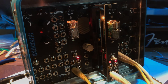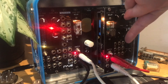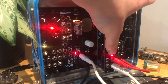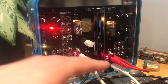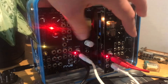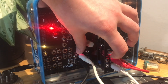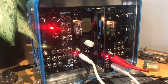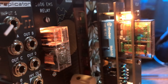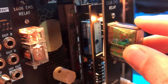If you've got two of them you can start to do logic operations. Here the output for the oscillator is going into the B position, so if I switch this over you'd expect to hear sound — but I've got the common plugged into this B position here, so only while both of these are pressed do you hear the sound. That's an AND gate, and you can easily expand that to do any logic operation you want. If you get enough of these relays, you can make a whole computer — this is really just the tip of the iceberg of what you can do with these modules.